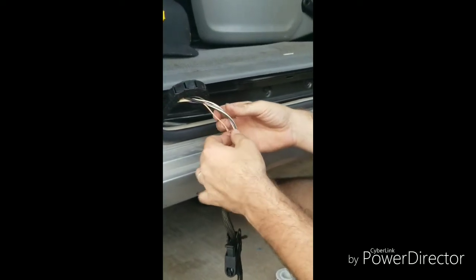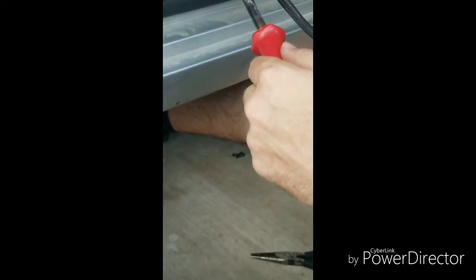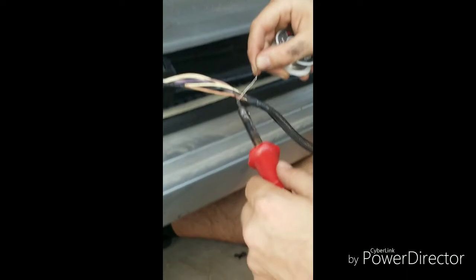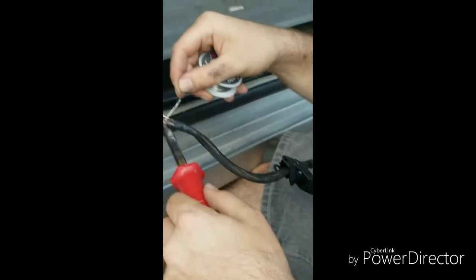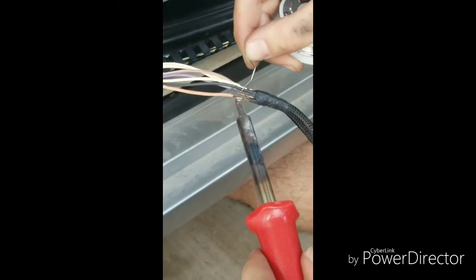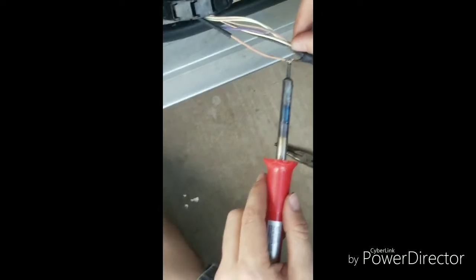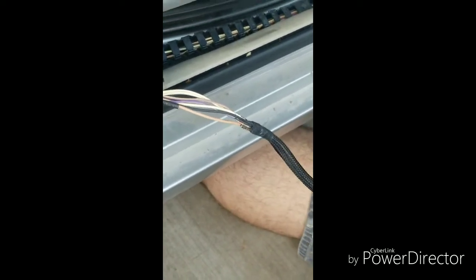Separate the wire to keep the heat away from the other wires — you want it flat so the heat will travel up. What you want is the solder to suck through the wire, actually suck down in there and make a solid one-piece wire. I want to make sure this is really good because there are actually free-moving parts inside this harness, so I want it really tight. Let that cool for a second before I put the heat shrink on.